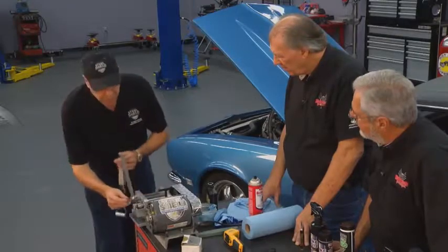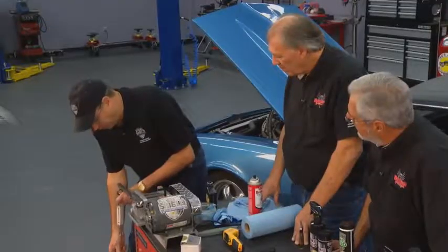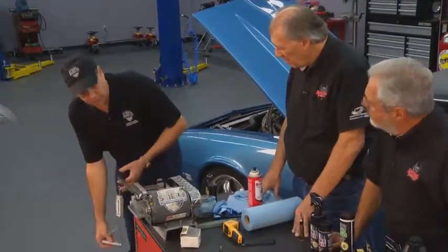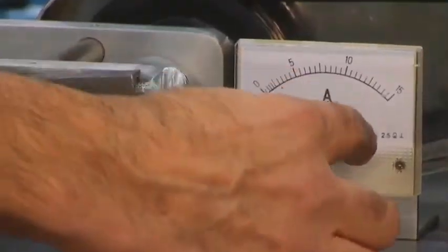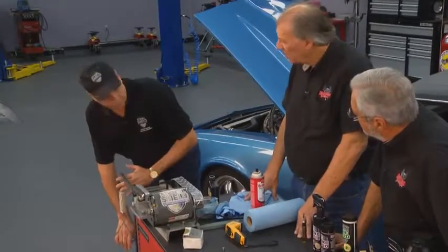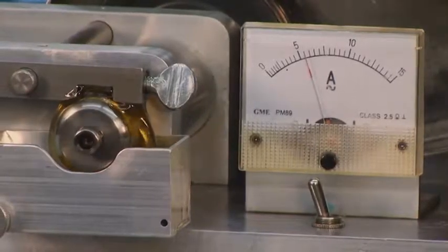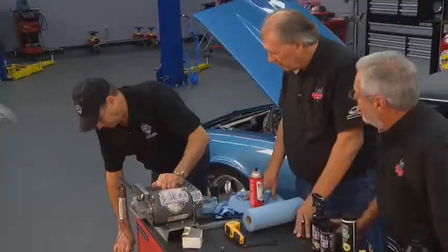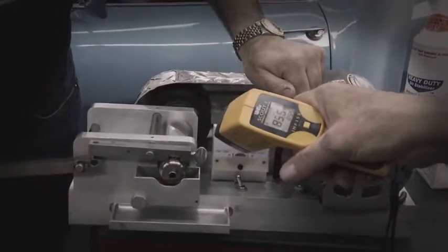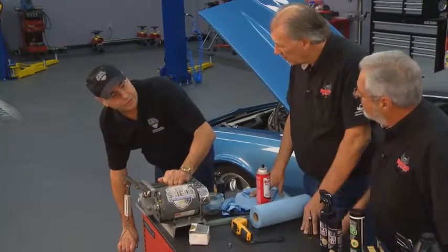What I'm basically going to do here is apply extreme pressures. Every pound on the scale is equivalent to over 30 pounds of pressure, point to point, with the fulcrum arm here. Okay. And basically, I'm going to turn the machine on. I added the product to the base oil. So basically the same oil we tested before, and it failed at what, 5 or 7 pounds? Right, right. Now you've added the Steel Shield to it. Right, which we treat the metal surface.